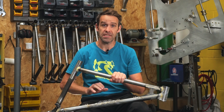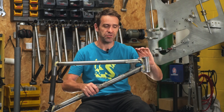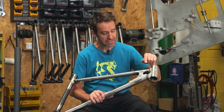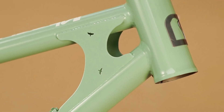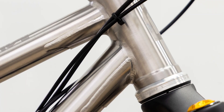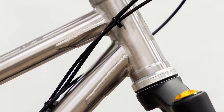Steel frames such as this and aluminium tubular frames historically tend to have some kind of strengthening feature at the front. There are two main ways of doing it: one is to have a plate gusset like this, which joins the top tube and the down tube together, and the other way is to have a little local doubler — a little extra section of material that increases the strength.